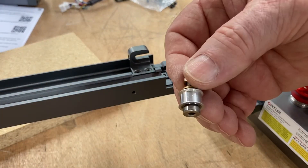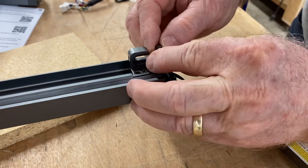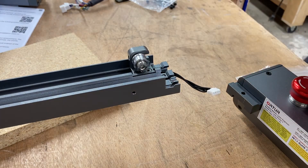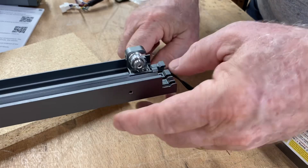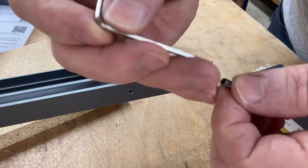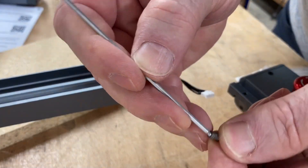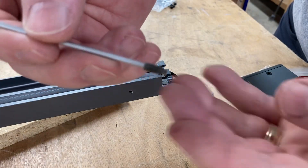It's now time to add this little pulley and add the belts. This just slides into the slot and is used to tension the belts. I'm going to temporarily snug it up so it doesn't move, and then it'll be time to attach the belts. Once the belts are attached and the machine is completely assembled, I'll come back to tension the belt to get the proper tension on them.